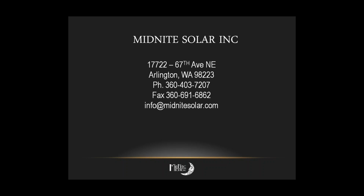And if Full River says it's okay to equalize their batteries, I would do that occasionally. I would not set it up for automatic equalization. Although, does the KID do auto EQ? The KID does not do auto EQ. It's manual. Yeah, it's manual only, and that's fine. I am not a fan of auto EQ at all. I like to be around my batteries when I'm equalizing.